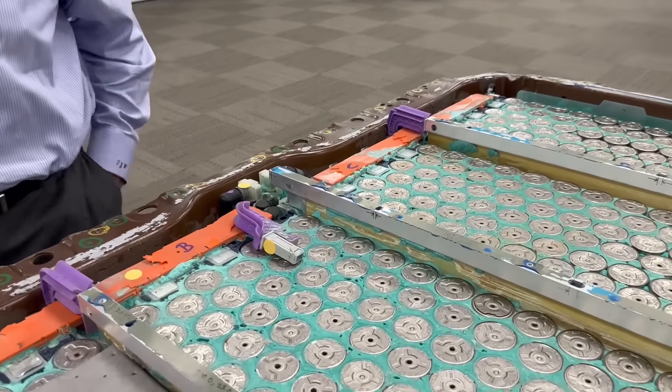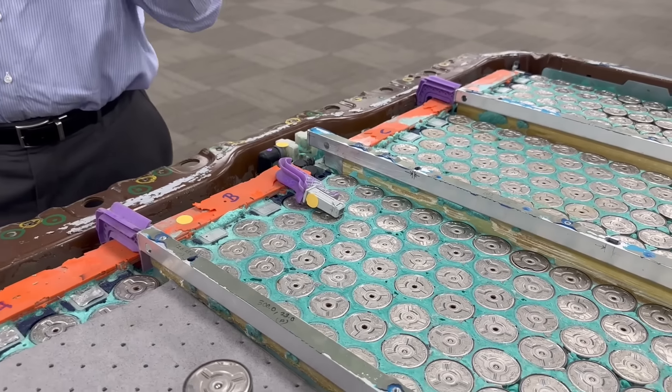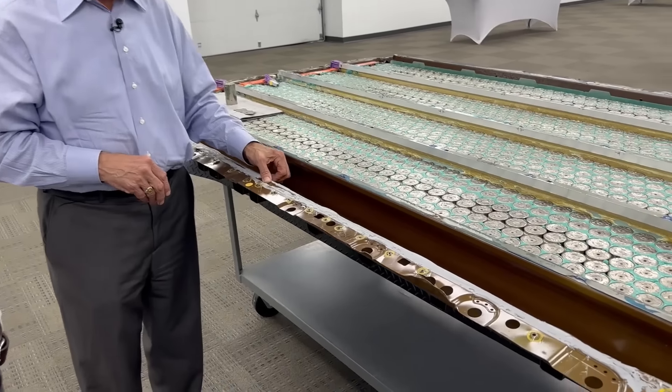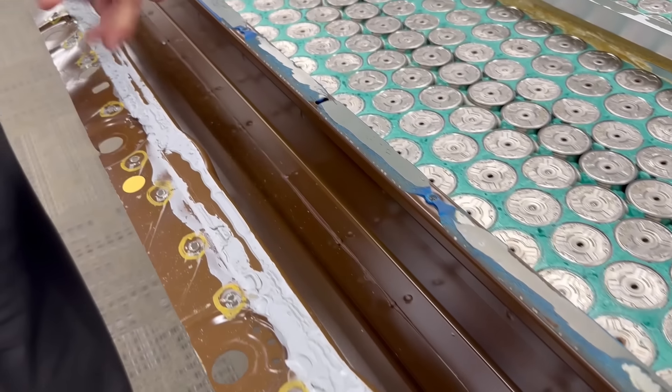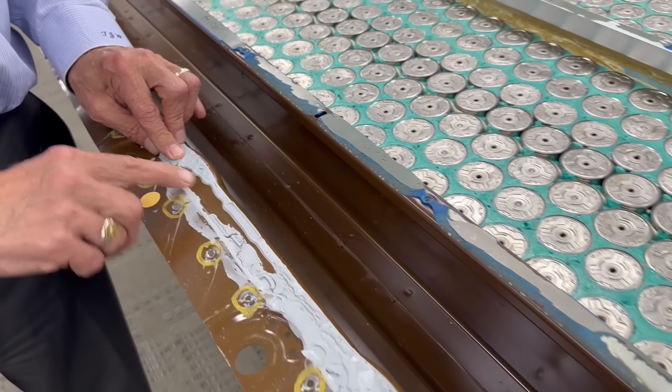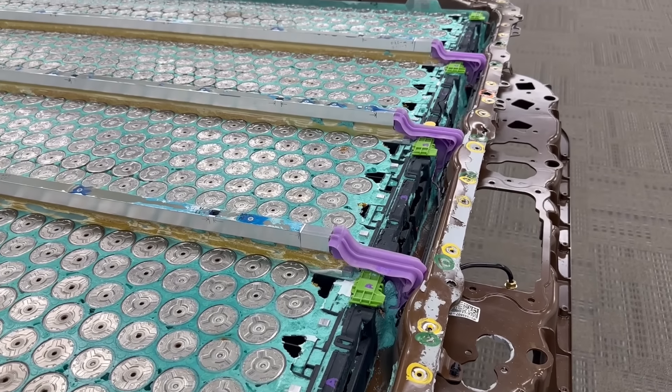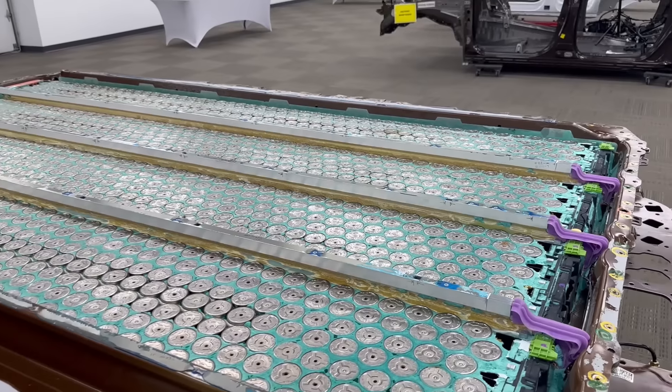Tesla is really good at design for manufacturing and assembly. They seem to have a real eye for it and a drive — how do we make it better, how do we make it more effective? This is very complicated, but how do I do it at rate, how do I do it quickly? When you tear the bottom off, it has a big seal through here. You'd expect the seal to break within the material, but you can see here it actually peeled away from the metal. It wasn't that it wasn't a full fill — it was — but just in this area it wasn't able to adhere to the metal directly. There was a little bit of oil or film that didn't allow it to cure really well there. Again, part of that process of how do we continually improve our quality and reliability.